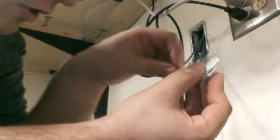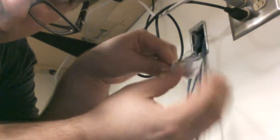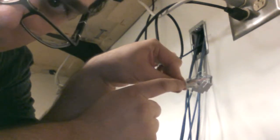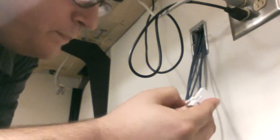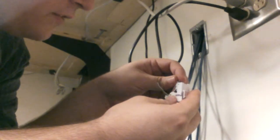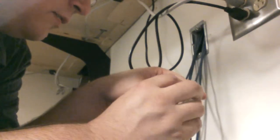So we're going to go ahead and start now with this. It's actually an easy setup. All you've got is a couple of color codes here — just match the cables up and get them in place through the teeth right here. You can't see it too well in that picture, but let me set it up and then I'll move the camera into place. I use B wiring here, so we know the orange and green has to be on one side while the blue and brown is on the other.